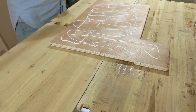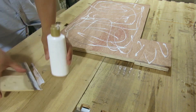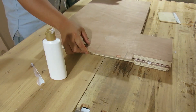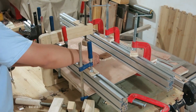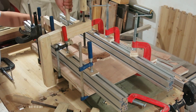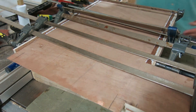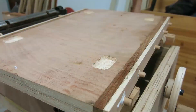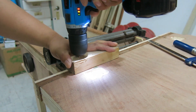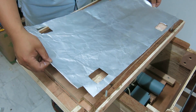I laminated 16mm plywood and a 4mm board, gluing them together for 36mm thickness. Then I used two pieces of aluminum to ensure it was flat. I had to widen the table because I made a mistake in table size. I transferred the drilling positions using four dowel center points and punched the table to leave marks on the bottom. The holes are on the sides so the threaded rod can be screwed in and tightened. I also stuck an aluminum membrane on to resist moisture.